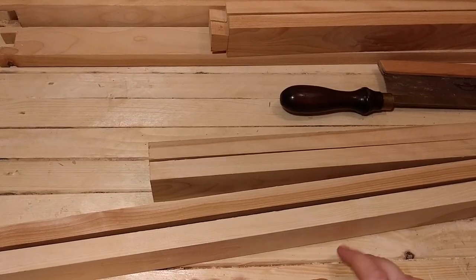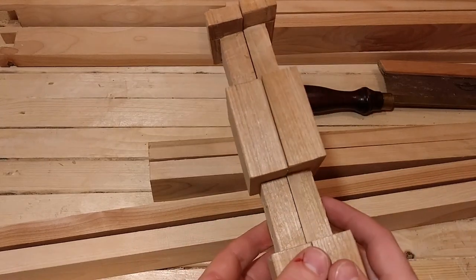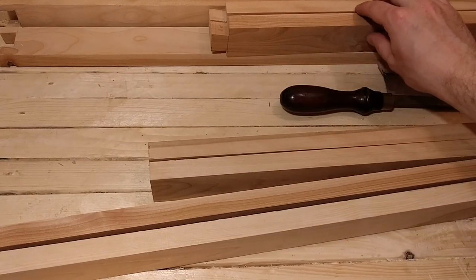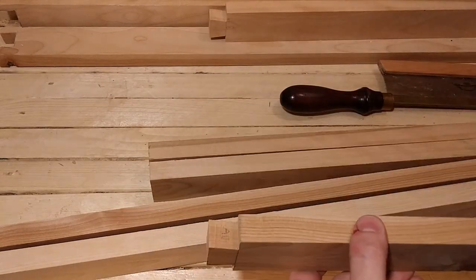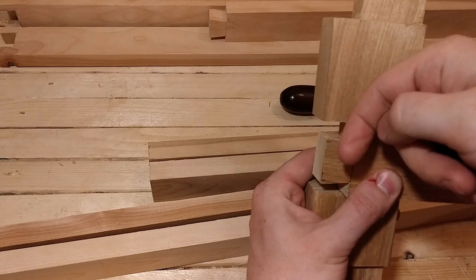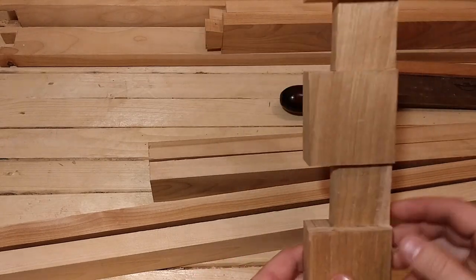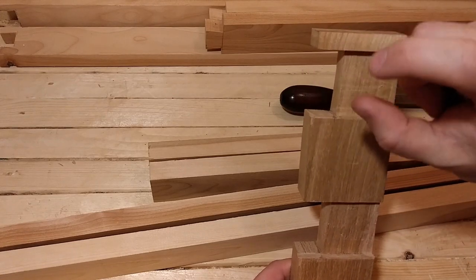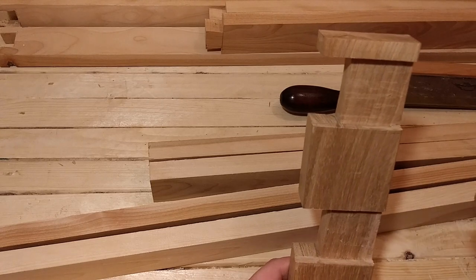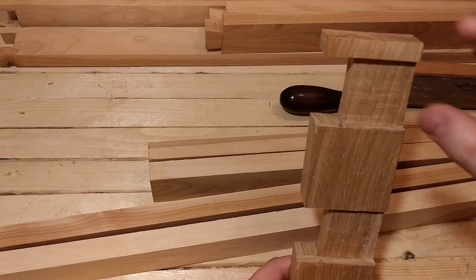I think last time I was out in the shed I finished making the bench posts — what you'd call the fence — to hold the babies in the wagon. I've gone ahead and started the rails. The rails are going to be dovetailed around the corner, so as they come around like this, they'll dovetail into the one coming from the other direction. The dovetails are fitted so that the top rail at the back has the dovetails holding the back rail in.